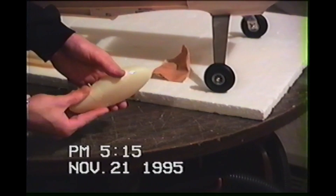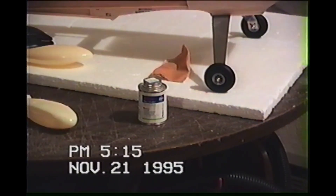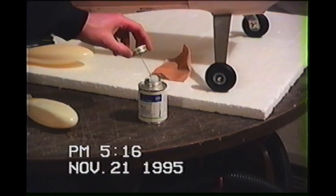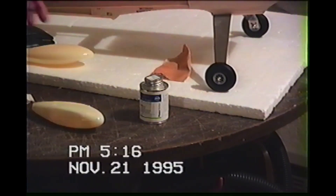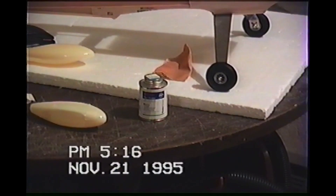I think I'll line it with some fiberglass too. What I did is I used some pipe cleaner — this is what you use on PVC pipe. It's a cleaner, a mixture of acetone and MEK. It did a pretty good job. What it doesn't do is glue them together — it just fuses them, melts them together. I think that's going to work and I can use the same thing on my cowlings. So I'm going to try and get that done tonight.